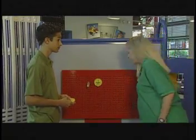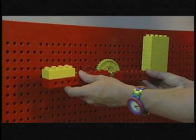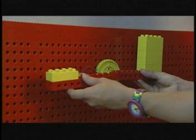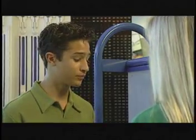Let's verify our results to see if the force is really multiplied by five. I'll place five bricks on this lever arm and place one brick the same distance out on the lever arm on the driver gear. It balances, so we were correct. We've multiplied the force by five, but the follower doesn't move very much at all. It's just like a pulley system. Whenever you multiply the force, you have to pull in a lot of rope to move the load a short distance.